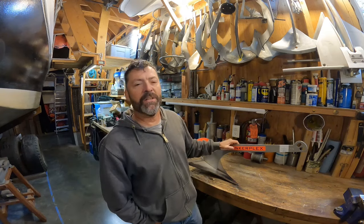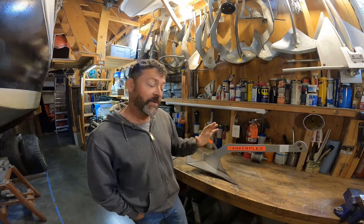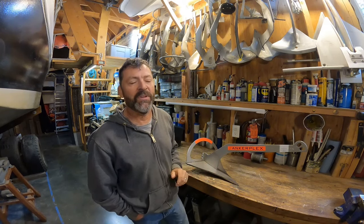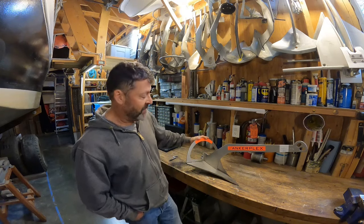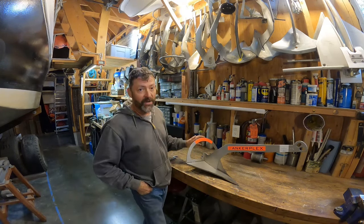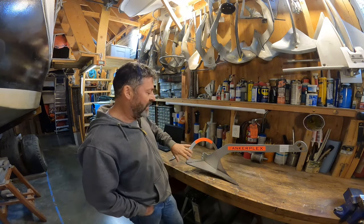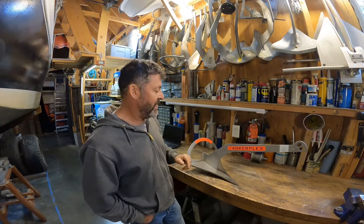So Ankerplex clearly did not build a top-performing anchor. However, it is a perfectly serviceable anchor. In fact, it really closely matched the performance of a genuine Bruce. Now, strength-wise, there's clearly some deficiencies. We did bend the roll bar back in that soft mud. However, being made of stainless steel, there was no galvanizing to flake off during the bending and straightening out process, so that's a plus.